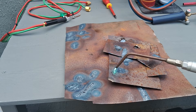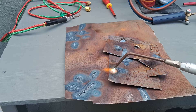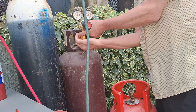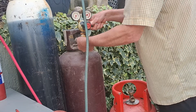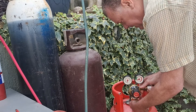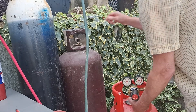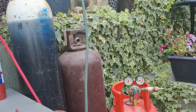That's a lovely hot flame. I just want to show you — putting the acetylene regulator onto the propane. A lot of people don't know this: it's exactly the same thread, just opposite-handed, just like the acetylene, and that screws straight on. There you go — exactly the same fitting as the acetylene.